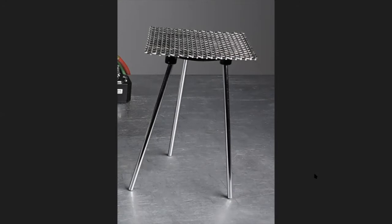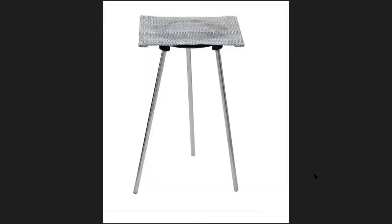This is a soldering tripod — I hate these things. I absolutely hate them. I don't know that I've used them more than once or twice without knocking them over. Also, the heavy screen on top is a great heat sink, and if you get your metal too hot, you're going to have an imprint of that screen on the back of your metal. Sometimes I'll use a fine-screen version and support it between two fire bricks — for some reason I don't knock those over. But for heating underneath, tripods do work quite well.